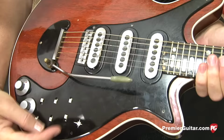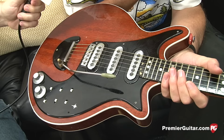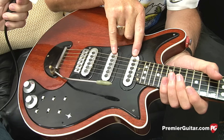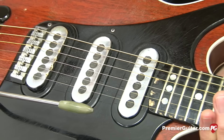There's a redundancy. They can be like this or they can be like that, which may make a difference in some places. But they're out of phase and they're humbucking, so there's not too much extraneous noise, which can be a real problem, as you probably know. And they scream. You just hit them. It obviously helps if you hit somewhere down here, but basically you get such a high cancellation of the fundamental and such an enhancement of those high harmonics that it screeches. It just screams. So all these harmonics will just zoom out without much encouragement. You can encourage them as well, but it gives me that lovely sound. I don't know if I can even describe it.